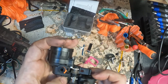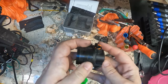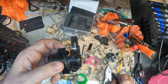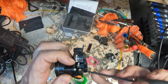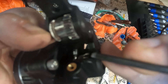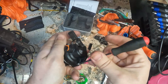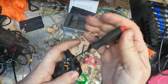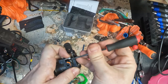Looking at the top of the filament path and how close to the gears it is - it's actually tapered and stuck into the groove. Having a metal exit means it's not going to wear out basically ever if you do a lot of abrasive filaments on your Mini. This is also good for the Bowden tube situation, because even on just PETG the Mini's Bowden tube won't last forever.